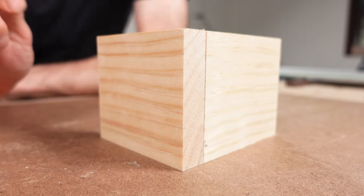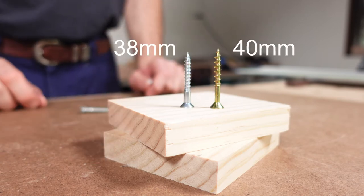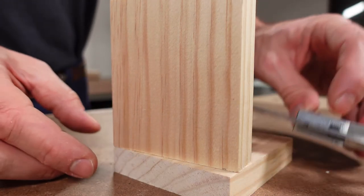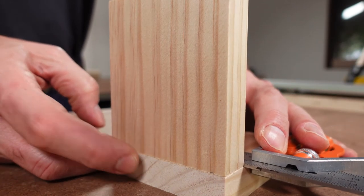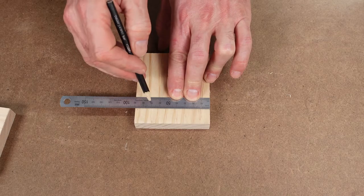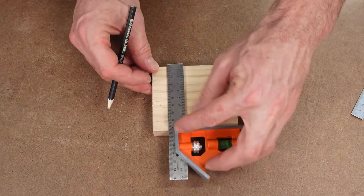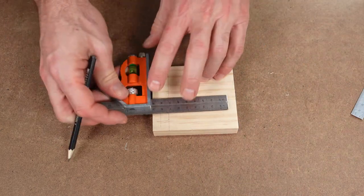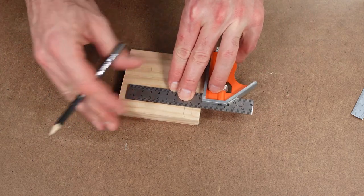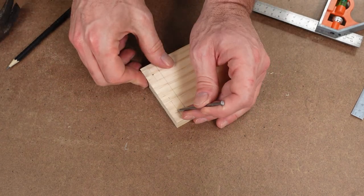You can be fairly arbitrary with where you place the screws. For a piece of timber 90mm wide like these two, I'll use two screws. For this exercise I could use 38 or 40mm screws to get the right amount of depth, because the timber is 19mm thick. I just happen to have 10 gauge screws for this example, but I could also get away with 8 gauge. Using this common process I'll mark out where the pieces connect by marking off the actual timber, using a trisquare to square it up. Once in place, I'll use a pencil to mark off the timber, allowing me to see exactly where the pieces will come together. I can be a bit arbitrary about where I place the screws — I'm going to come in 15mm from each end and then ensure that each screw is located down the centre line of where the two timbers meet.